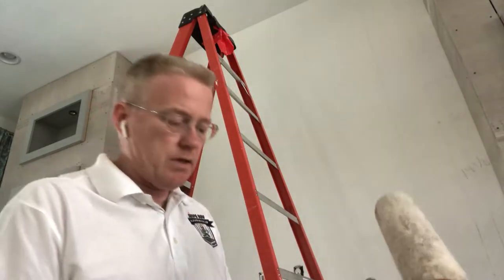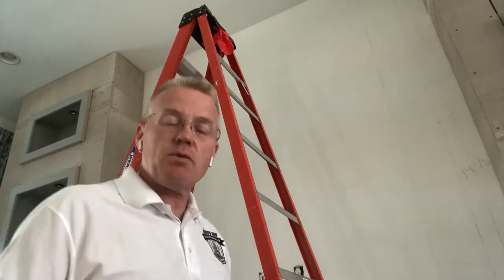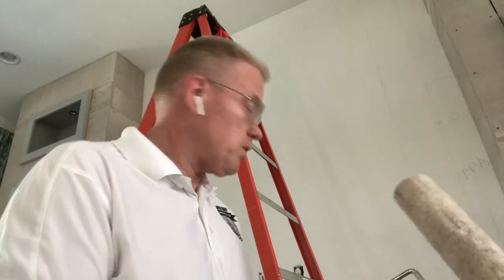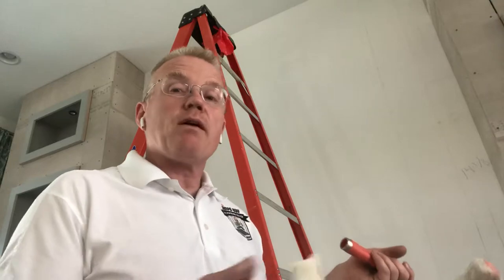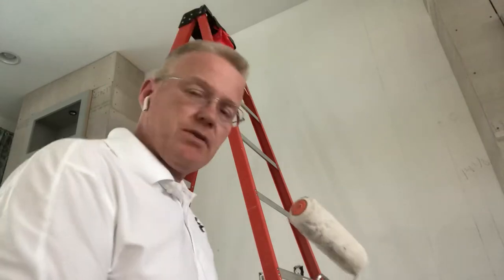I'm going to put it on with a brush to get into every nook and cranny, and then also with a roller to speed up the process. You do want to use a brush to get into every nook and cranny, because if your wallpaper fails, you know where it's going to fail? Along the whole perimeter — that's actually the most important place. The reason we put it everywhere is so the customer can take the wallpaper down when they want to. If you don't put it on, the glue will become one with the paint underneath it. And if that surface wasn't prepared properly, it'll all become one with the plaster or sheetrock and rip it off. This is why people don't like hanging wallpaper — because the walls aren't prepared properly.